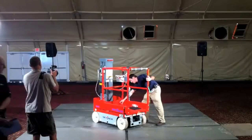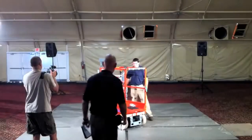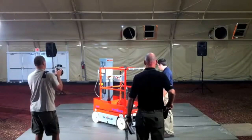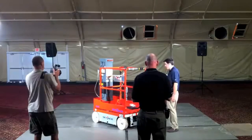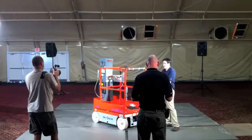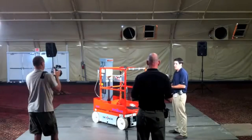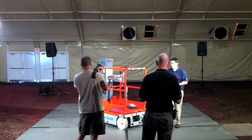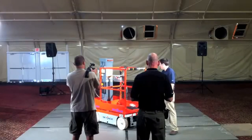The platform is all steel construction as well and fully modular. So it bolts on to the outside mast section. All steel construction, standard checker plate tread design for the platform deck, so a non-skid type surface. Even the railings are 100% modular. You can actually unbolt all of these railings and collapse them down. So again, just from a parts point of view, it minimizes the space required on shelves. If you want to throw a railing set in the back of a pickup and do a swap out on a job site, not a problem at all. You don't have a whole basket-shaped thing taking up a lot of air.